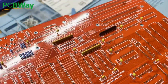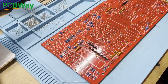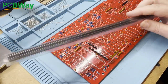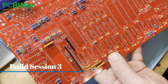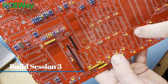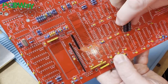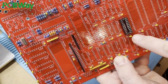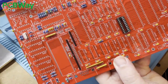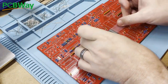With integrated circuits in mind, it's time to put all of the sockets on the board ready to accept those aforementioned chips — and there are a lot of them, which means a big old soldering session. Now, you've heard me say this many times, but it's worth repeating: the notch in the socket lines up with the notch on the chip, and also with the notch on the PCB silkscreen. It's easy to put one of these in the wrong way round and it's a nightmare to put it right later. This board is really nicely designed, with all of the ICs being oriented with pin 1 and therefore the notch to either the left or the bottom — a useful touch.